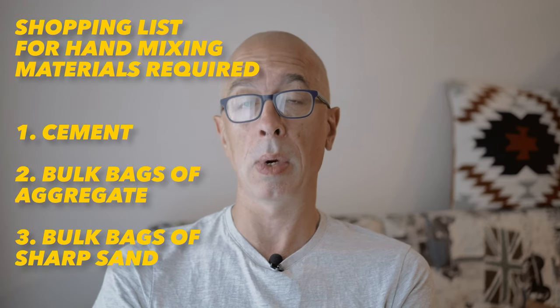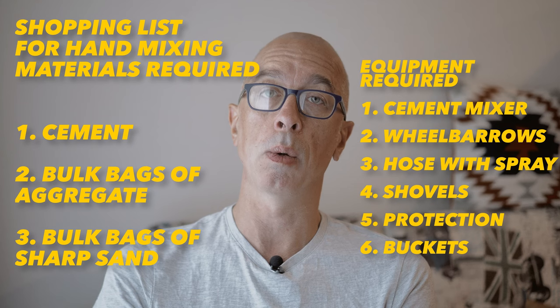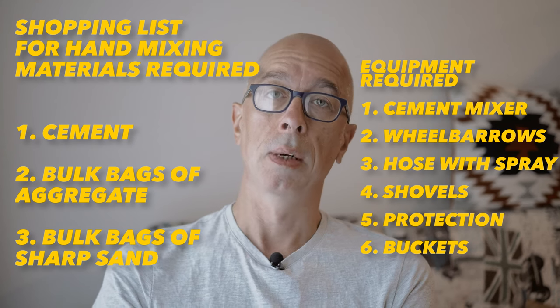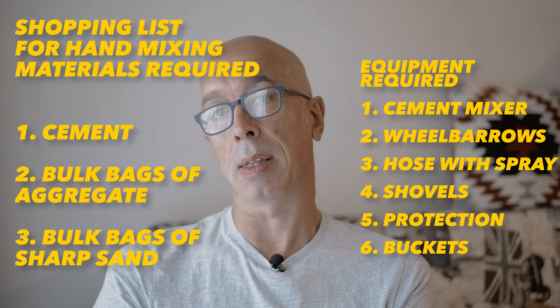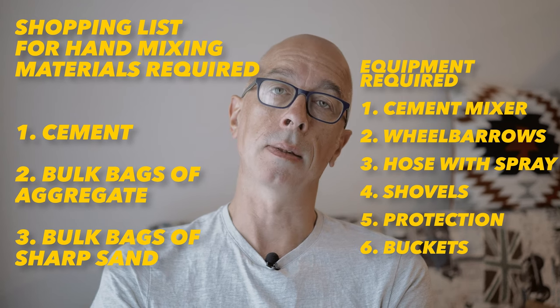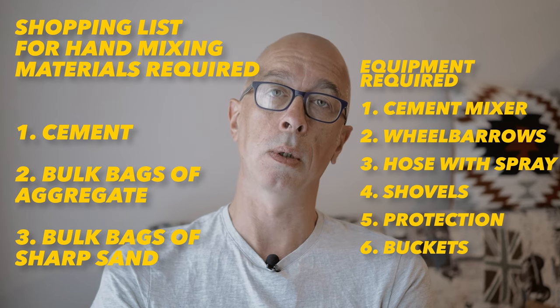So let's start with hand mixing, which involves buying three ingredients: aggregate, sand, and of course cement. I'd also advise getting a cement mixer as well as a decent wheelbarrow, a hose with a variable shower attachment, two decent shovels, big and small, something to protect the ground from around where you're going to be doing your mixing, and some reinforced buckets to do your batch measuring. Once you get into a groove, you can just use shovelfuls, a bit like a cook does with their spoonfuls